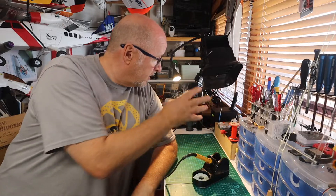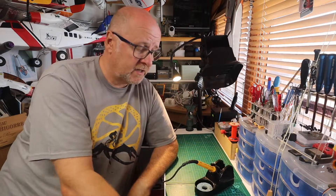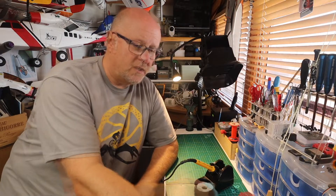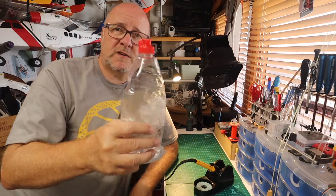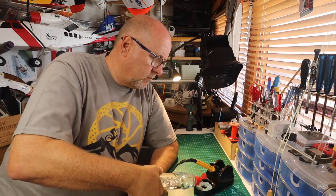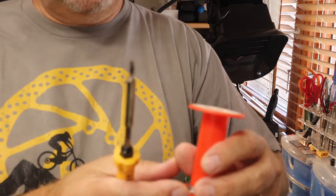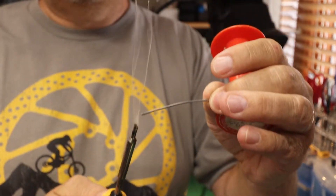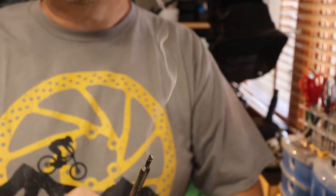If you've set yourself up a bit of a soldering station, you'll have a soldering machine and a stand, and you get these bits of sponge which can tend to be a bit dry. A little tip — an old fairy liquid bottle, squirt on a bit of water. When you're soldering, you'll see that there's a lot of smoke, and that smoke is harmful. It's the resin from the flux, and there's lead in there.